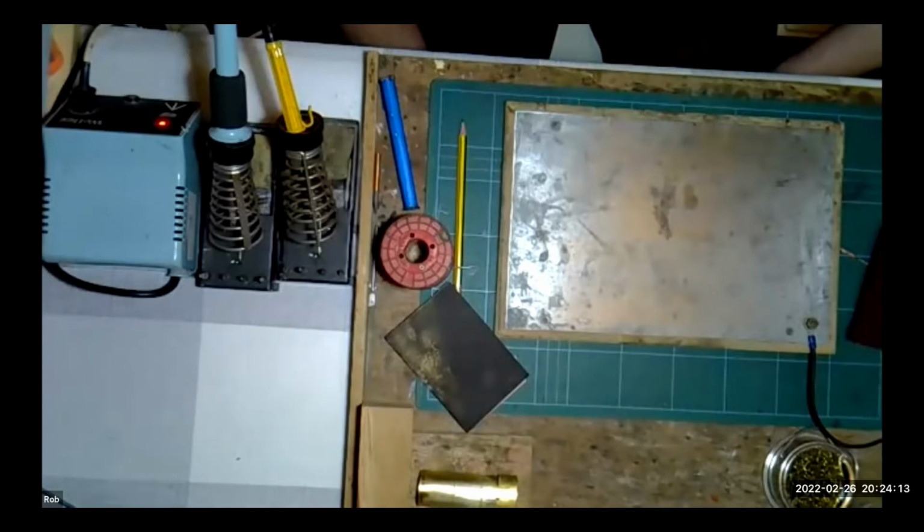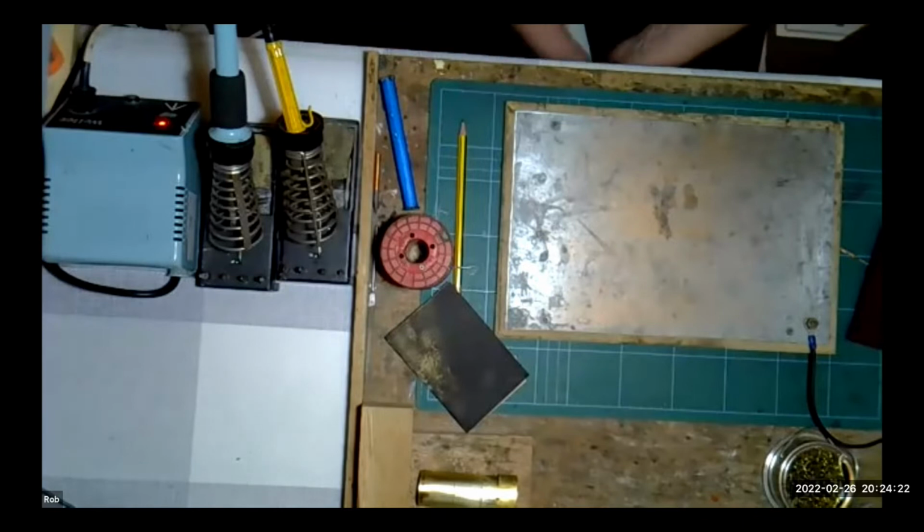That's great, yes. The final part is again the old solder question: solder paste versus creams, or what? This is a personal thing with me. I have tried solder creams and solder pastes and solder paints. I don't particularly like them. I tend to tin everything and then sweat it together with the resistance soldering unit.